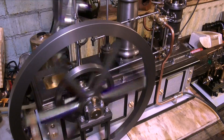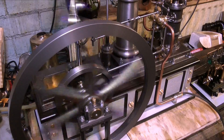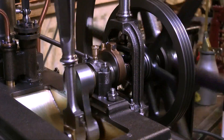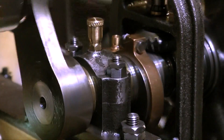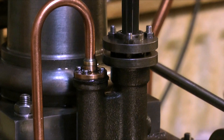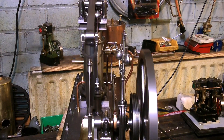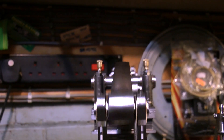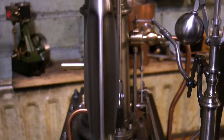Time to speed up the engine now. The idea of speeding up and slowing the engine down gives a nice even running-in period — it will take quite a while. Although the engine is not particularly stiff, everything is quite free and the sound is wonderful. Here is the crankshaft with the connecting rod, and note the oil cup with the removable cap, threaded and knurled. Here in slow motion is the water pump. Once this engine is fully running, I would expect it to run down to about 10 revs per minute. Each time we run it, it seems to get better, and once the oil runs clear from the bearings, we'll be getting somewhere.